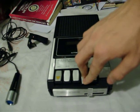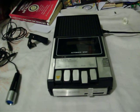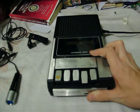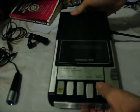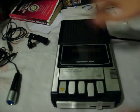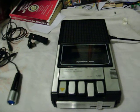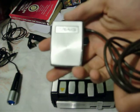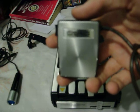The erase head does not work very well. Let's try the usual scheme: testing one, two, three, four on the Candle cassette recorder, which boasts automatic stop and automatic level control. But my internal condenser microphone is very, very loud. And it probably becomes much more apparent when I try plugging in a dynamic microphone — as I am now — that this machine is DC biased.